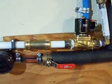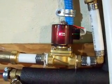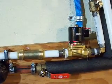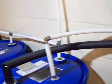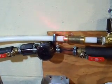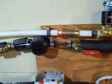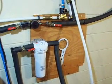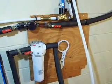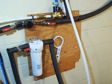When you're shopping for a solenoid valve, the one I chose is a ¾ inch Viton seal — a nice $30 to $40 online item. You've also got to make sure you have a check valve, because if the system fills up completely with rainwater, the rainwater will collect and go up this tube and you don't want to contaminate the city water with your rainwater. Although it's clean, it's not sanitary — so this is a must. Another tip: if you can find a piece of plywood, it's a lot easier to mount that against the wall and then mount your components to the plywood. Drilling a lot of holes into masonry is not something you want to be doing.